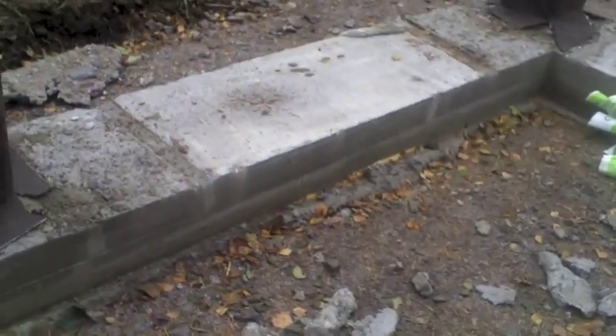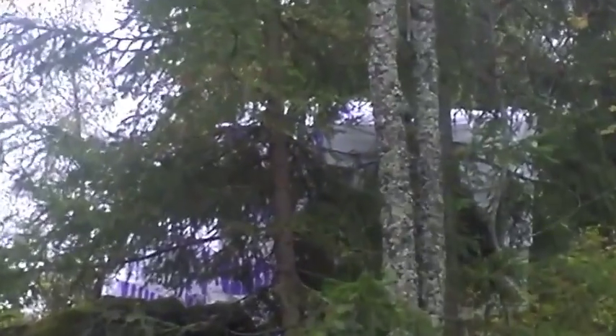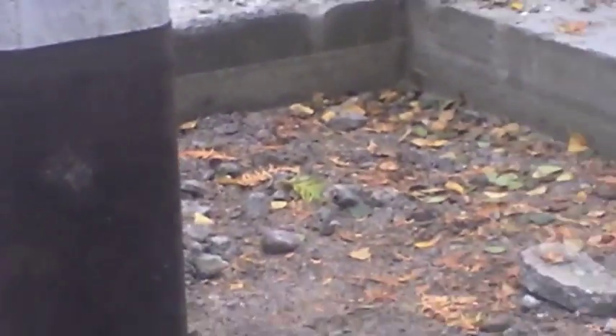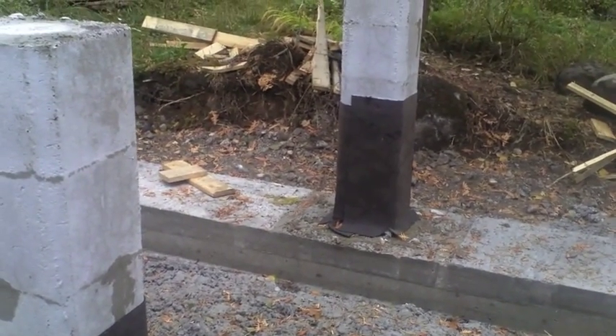Into the sauna. Round about here is some sort of felt around the pillars, which stops the water getting into the pillars and creeping up and getting to the wood in the cabin. The sand should be coming up as high as that. Styrox gets put down as well. All these pillars have been treated, so there's no chance of water climbing up now from underneath.